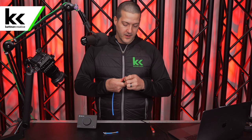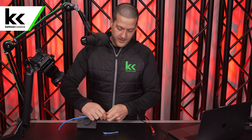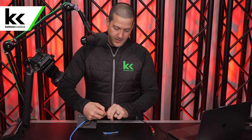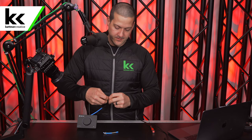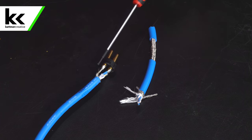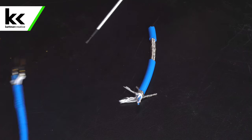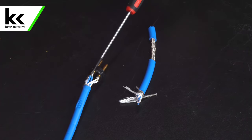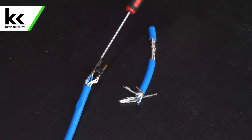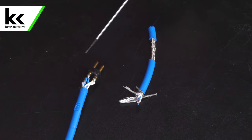Now let's take a look at how it's wired on an XLR connector. I'm going to pull this off and take all the protective pieces off of it. You can see here the tin shielding from the outside of the cable gets soldered to one of the pins, then both blue cores get soldered to the same pin, and both white cores get soldered to the same pin — so you're running them in parallel.